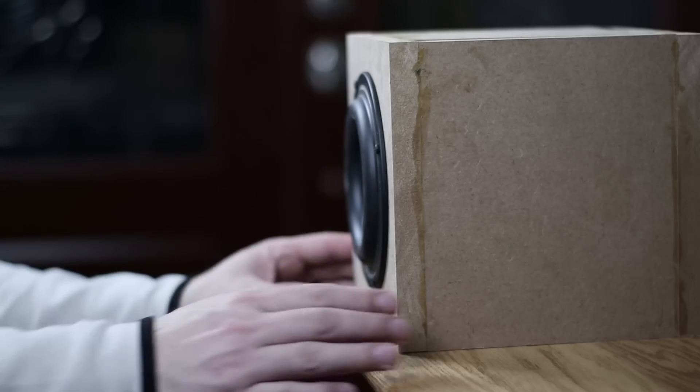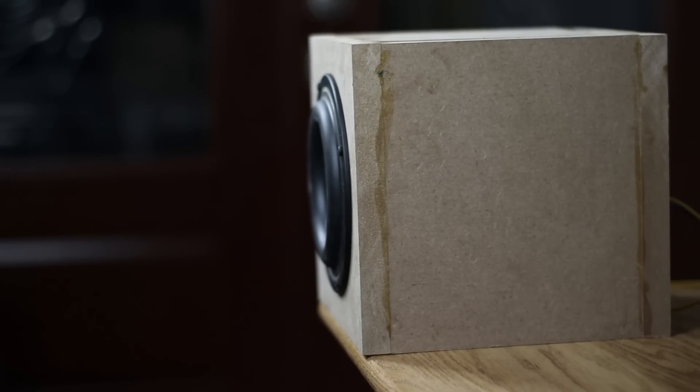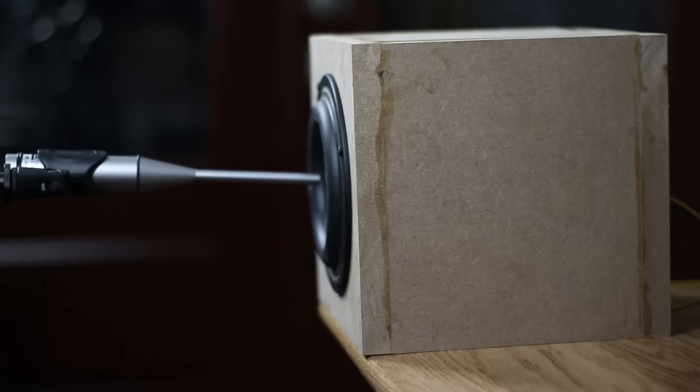There is one issue: if you really want to do this, you're going to need to get a measurement microphone. Without one, you're just guessing and you really don't know exactly how much polyfill you're going to need. No one can tell you unless they've already built the same speaker. So if you want to start building smaller boxes, you should get a measurement microphone. I link some in the description — such as the UMIC-1, which is a fantastic microphone, and of course the Dayton OmniMic, which is my favorite especially for doing a lot of measurements.